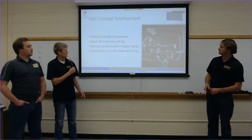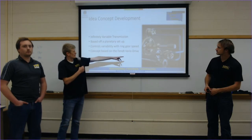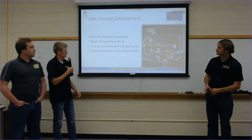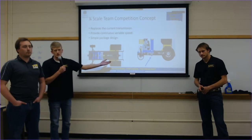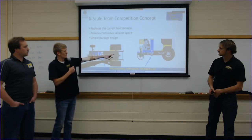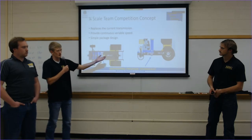This is the picture of the VarioDrive variable transmission. They use hydraulics based off their ring gear drive. They have a pump that changes displacement, and that's how they change the speed of their ring gear to get different speed output. Here's a picture of our CoreScale Tractor, showing where this infinitely variable transmission will go into place. We'll still have our initial belt reduction, but then we'll go into our IVT, replacing the traditional transmission.